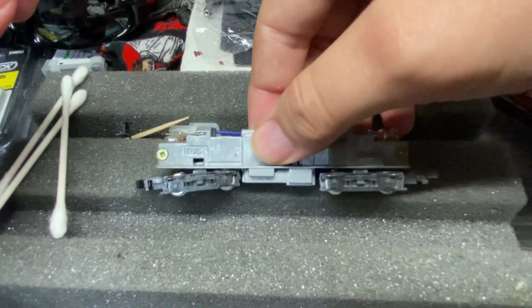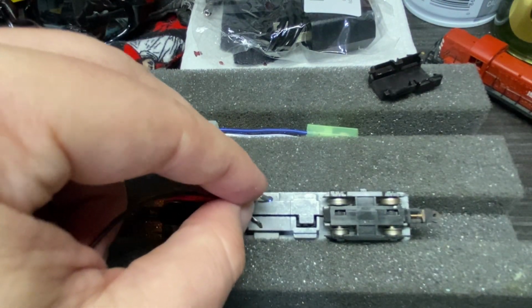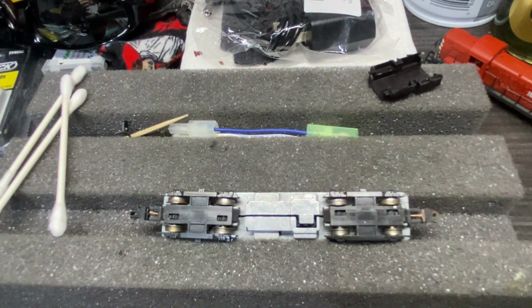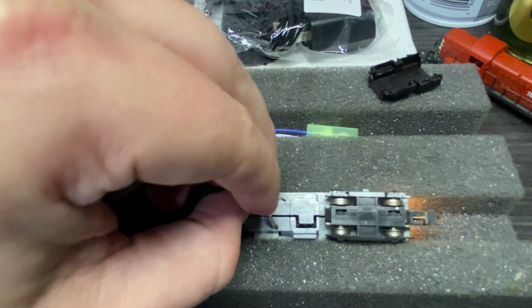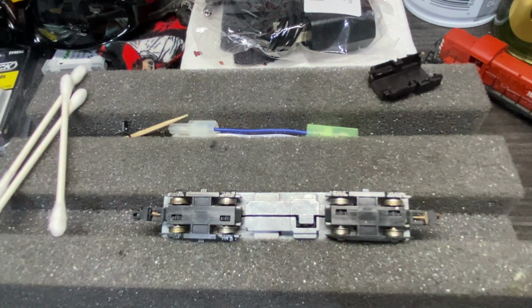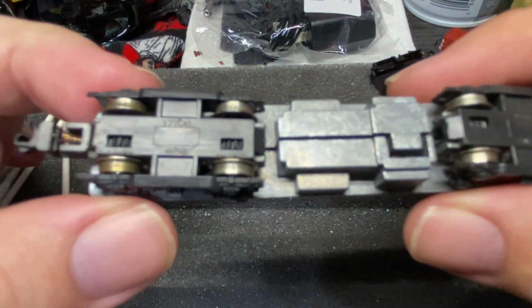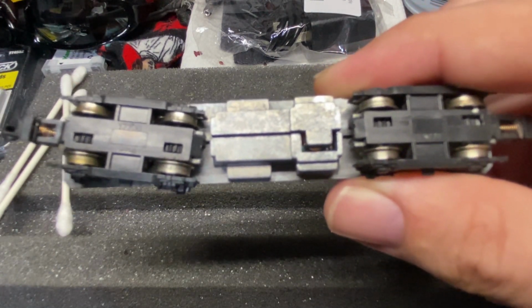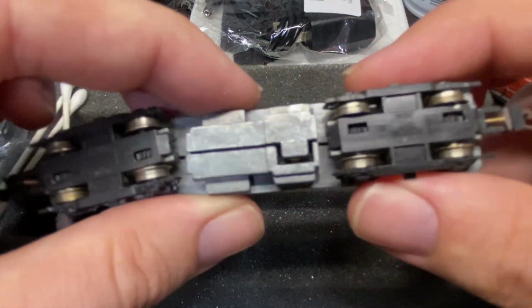We've got our power. Flip this over here, and we're just going to go right to the chassis. We'll flip our electrodes around and see if it goes the other way. Seems pretty good. So from the chassis to the motor, we seem to be having good contact, which means we're probably dealing with possibly some crusty wheels. These don't look too good. Just get the camera to focus on this. I'm trying an iPhone with a different mount here to see if we can do better than the old GoPro.